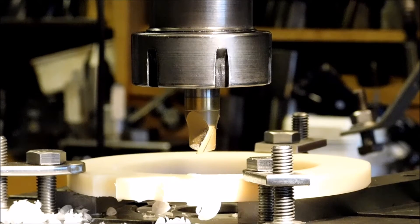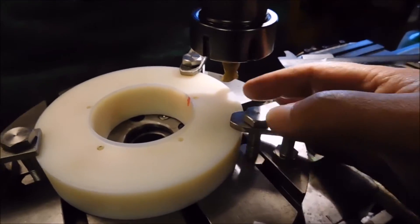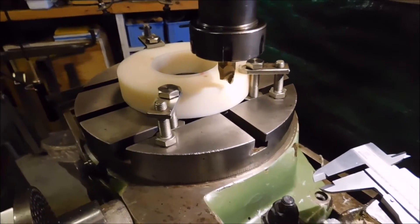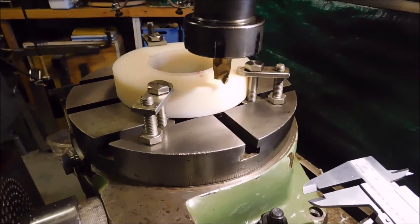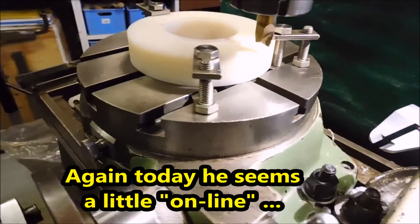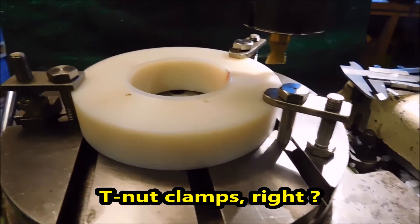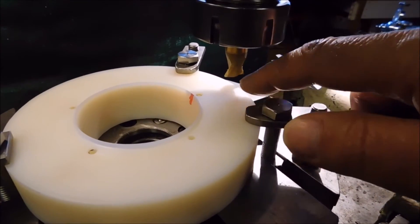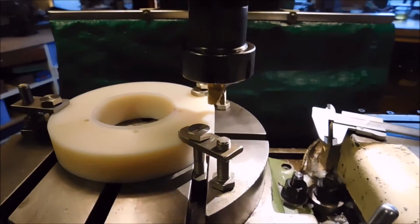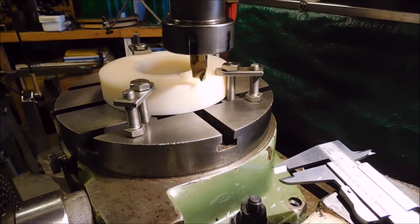Now I use the exact same setup for making the thumb hole — what we call the base hole — for moving the center ring, so you have something to hold on to when you are pressing to move the tilting ring. I used my small fixtures here for setting it up in the rotary table. I only want one hole in this ring, taken at the mark of zero degrees. I think I'll make it a depth of 10 millimeters, maybe 15 — let's see how it runs.